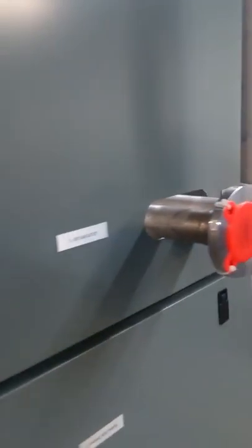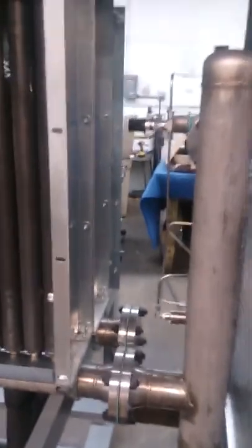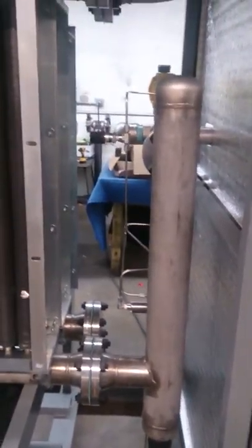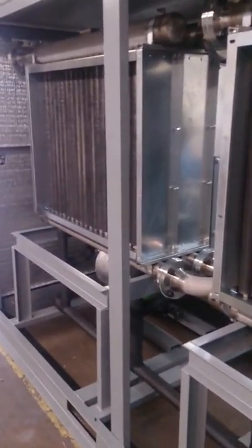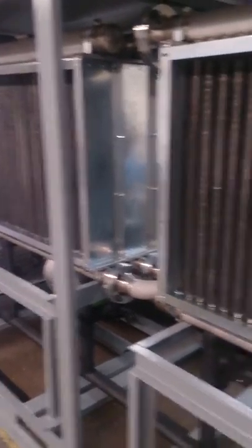This is the output of the system right here. You can pull this door off right here — you can see it says manual reset inside. You can pull this door off these latches and manually reset it. A lot of times people will use these systems replacing the J models or N models, where they're taking it back to the burner. Because with all these fans on here, you do pull almost all the condensates out — in fact, all the condensates out in the steam. So you get very, very dry gas coming out of here.